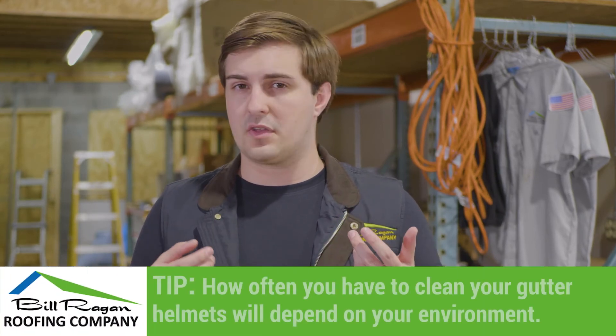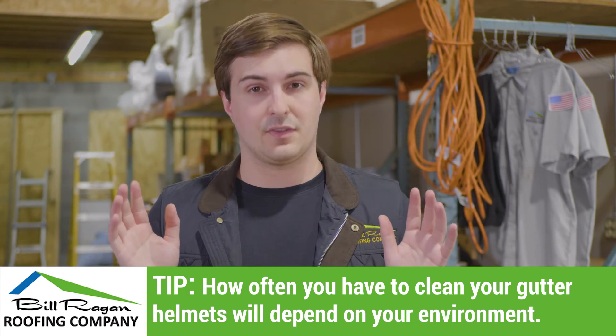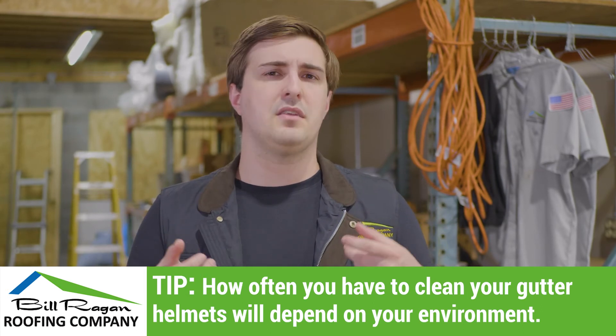It's not a perfect system though — you'll still see some water make it through and onto the ground, so we don't actually recommend gutter helmets if you have a basement. The other main cons are that they're the most expensive of the three options and the hardest to clean. You will rarely ever have to clean your gutter helmet, but when you do, you're going to need the manufacturer's people to come out and do the cleaning for you. Also, unlike gutter mesh and gutter screens, gutter helmets are a little less low profile and can possibly be seen from the street, so you may have to take aesthetics into account when purchasing.